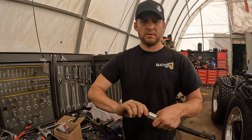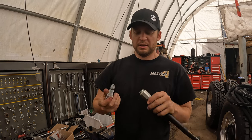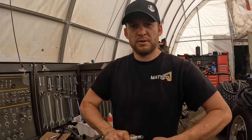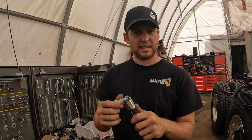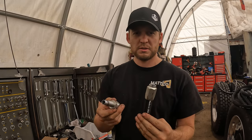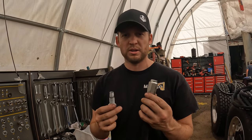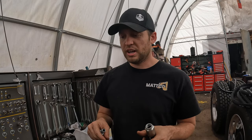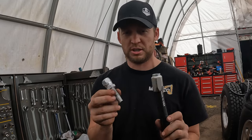You can totally take these fittings out, pop them off, and reuse them. So if you've got to re-run the line or you cut it, you can just take these fittings off and put them back on. They're reusable, field serviceable — and I really like field-serviceable equipment. Those compression fittings, you use them once and they're done. Push locks fill up with dirt and sand and are basically one-and-done. Once they corrode and fill up, they're finished.